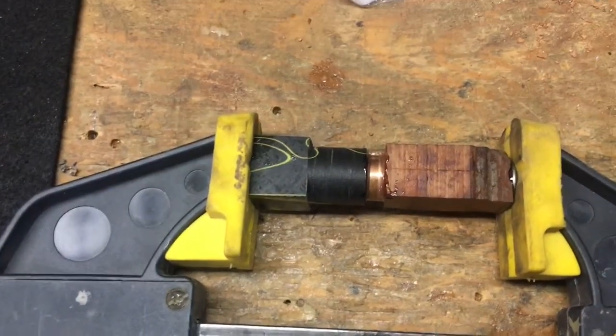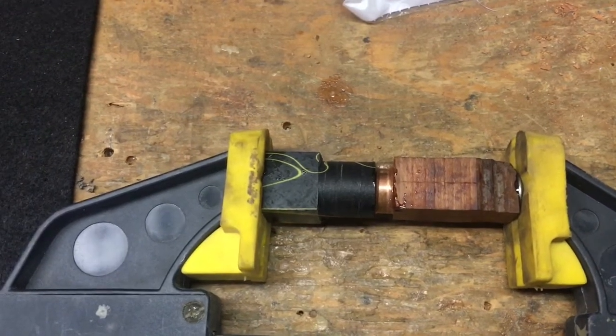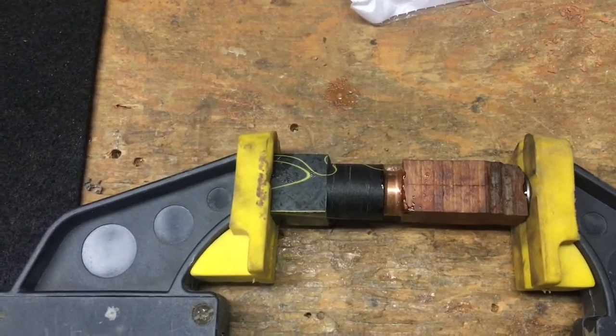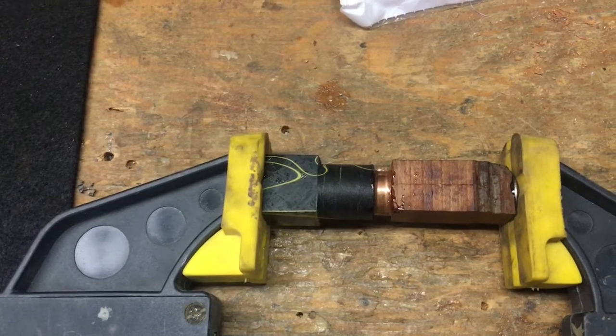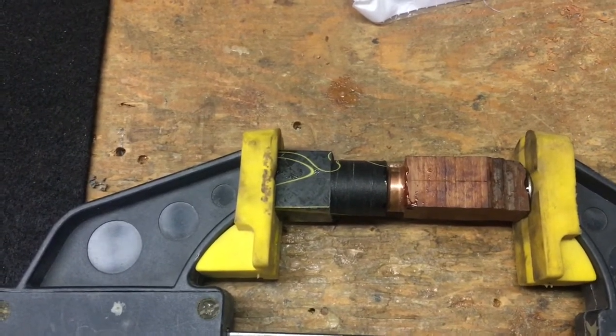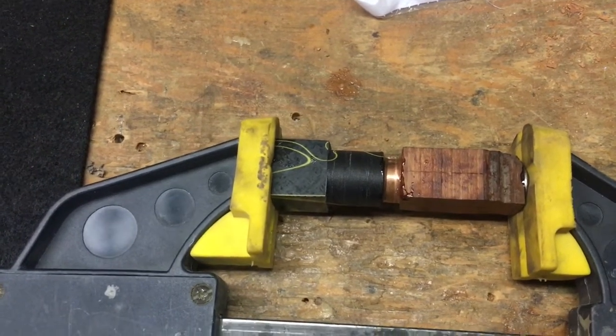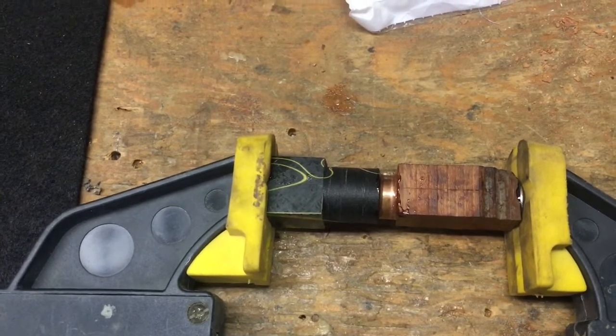This one's going to be a little more challenging because of the copper ring. Copper doesn't sand as fast as wood or plastic, so if I have to taper it at all it might be tricky. Also, when you sand copper at high speeds it heats up really quickly, so I don't want it to melt into the plastic or ruin the glue-up. I just have to go slow with it.